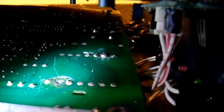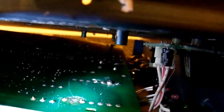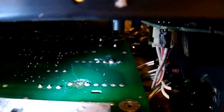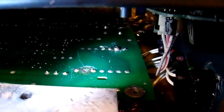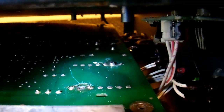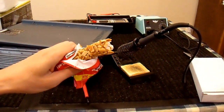Up here you can see a strip of copper that the other side of the choke attaches to. This is on the output side and it's a 1500 watt inverter, so it only needs to handle about 12 amps. I'm just going to shove that choke lead back in, solder it up good, and test it out. If everything works, I'll glue it down properly. When an output choke like this comes loose it can be nasty on the circuitry — you can get very large voltages. Salted nut roll — it's the perfect soldering snack.